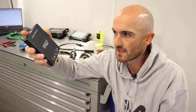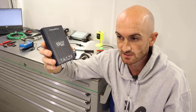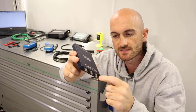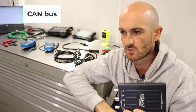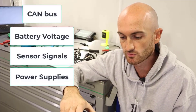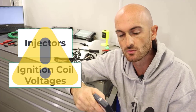Just something to be aware of with this is it's not marketed as an automotive oscilloscope because there are a few specifications which make automotive diagnostics potentially a little bit difficult. One of the first things is that it can only take a maximum of 20 volts into either of its two channels. That's fine for most things like CAN bus, battery voltage measurement, sensor signals, power supplies, and pulse width modulation - as long as it's below that 20 volts. However, if you're going to measure things like injectors or ignition coil voltages then you're going to need to go higher.